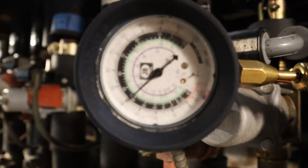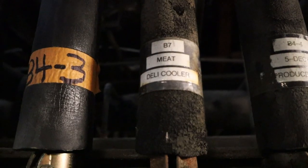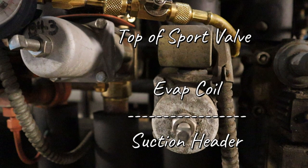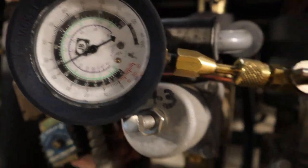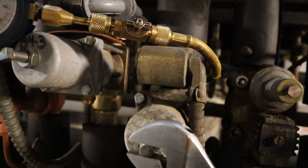It's a little bit stiff, otherwise I would have gotten more. Now it's just a waiting game. Pretty much all that back pressure is going to the box, holding back pressure. On top is the EVAP coil pressure; on the bottom is the suction header pressure. The meat box is usually tied into the plus 20 or plus 15 suction group. Right now reading 44 — I'm trying to get it to 46 or 47, so I might do another adjustment.